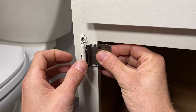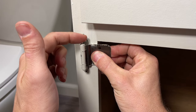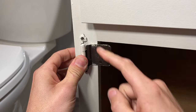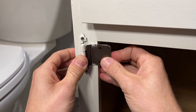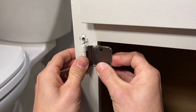With this hinge, you can see the painted surface that I want to cover up, so I'm going to note the overall shape and design of this mounting surface — and that is the face mount. You can see it's mounted flush with what's called the face frame of the cabinet. So that's one feature of this hinge. The next feature is the closing feature.